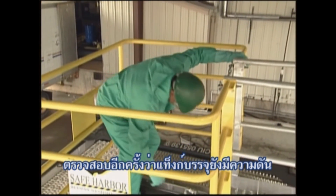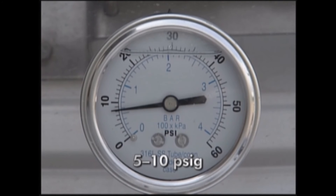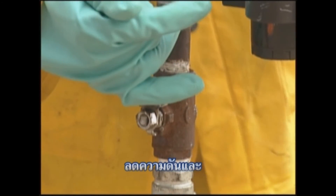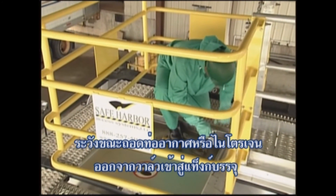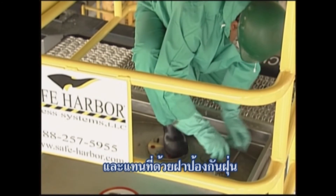Recheck to see that the tank container is still pressurized with 5 to 10 PSIG of nitrogen or dry air. This will assure that moisture will not enter the tank container and react with the residual MDI on the return trip. Finally, depressurize and carefully disconnect the dry air or nitrogen hose from the tank container's inlet valve. Remove the adapter and replace the dust cap.